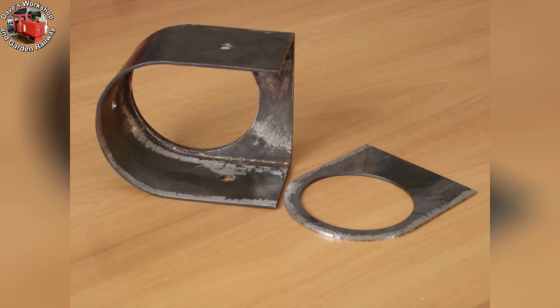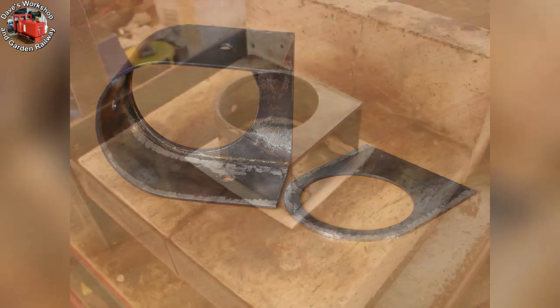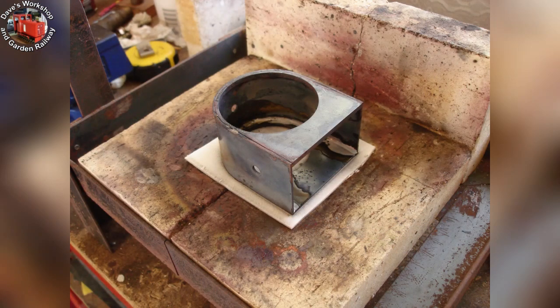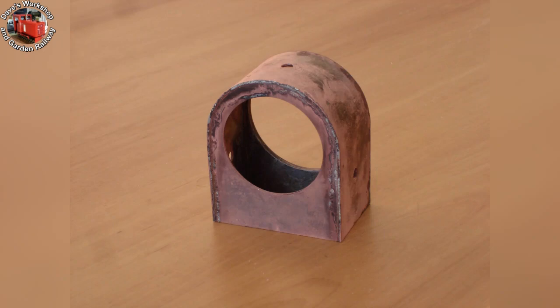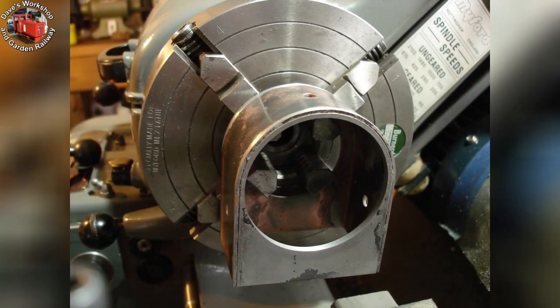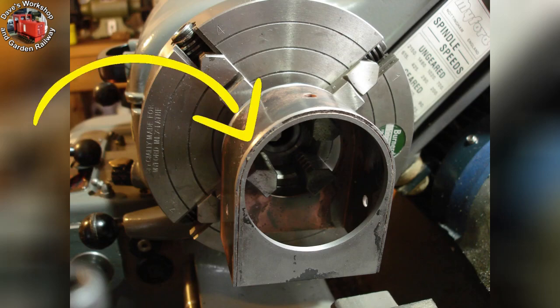The job has been cleaned up by Dremel for brazing the front plate. The front plate has been brazed. The job is sat on a piece of refractory paper to keep from wasting heat into the fire bricks. Pretty in pink — I pickled the job in my citric acid bath, which has seen many dunkings of the quarry hunslet copper boiler, imparting a microscopic layer of copper onto the steel. Here's the front; a smokebox door is needed. I put the smokebox on the four-jaw chuck to skim the bores. When you bend sheet free-hand without bending rolls the edges always rise up — you can see where I have filed these down.